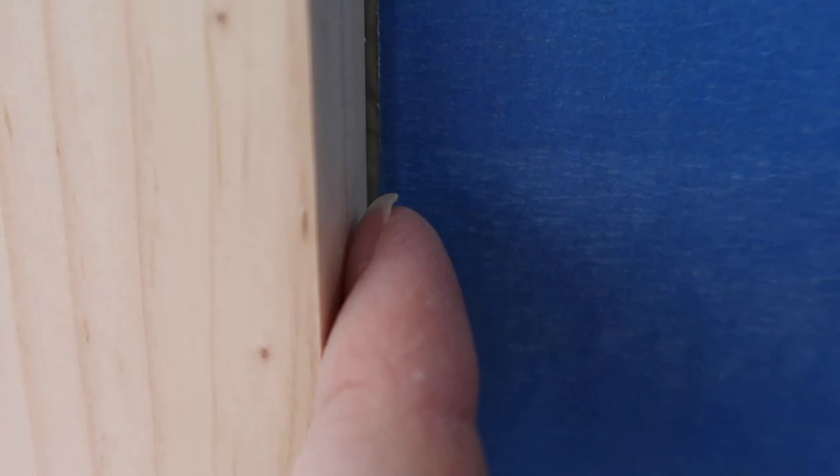When I am taping for a project like this, I'm leaving a little bit of a gap and not completely getting the tape right next to the trim, because when I caulk this I want to make sure it gets not only completely behind the trim, but I also want a little bit to cover here so it creates a nice smooth seam.